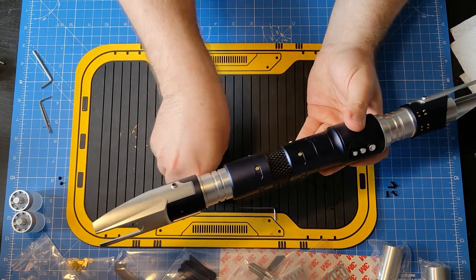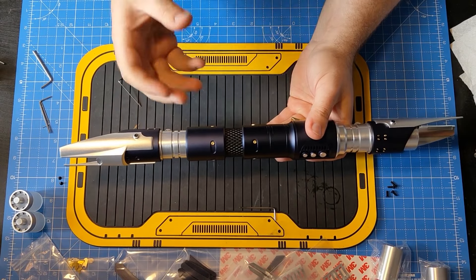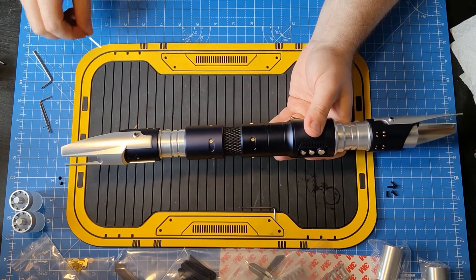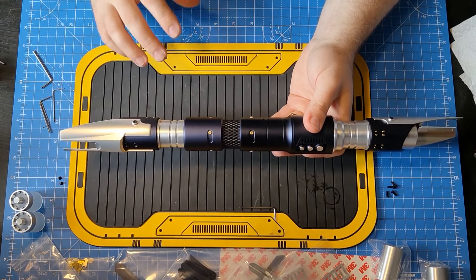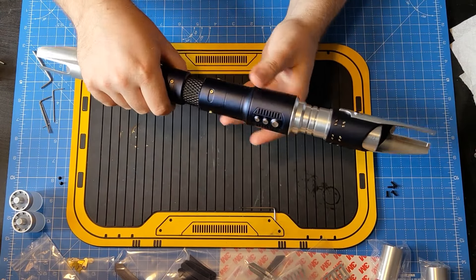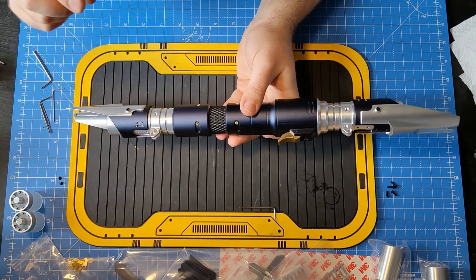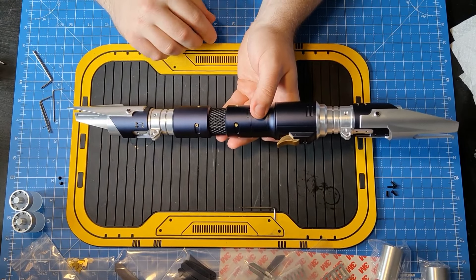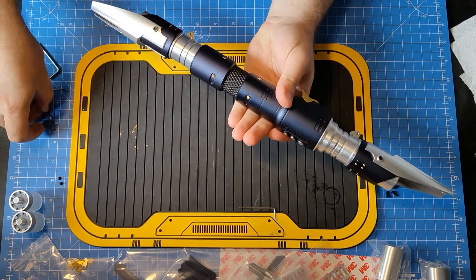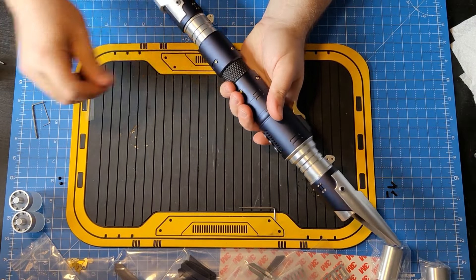There's hidden sound venting here and here. The idea of having the speakers pointing opposite to each other is that if you have speakers pointing at each other, what you're doing is cancelling out the sound and distorting your sound and actually quietening it more. This is a very hard hilt to get good sound venting out of just because of the design of the hilt itself, but what we've got here is pretty nice — I'm quite happy with that. Those are 22mm speakers. The single board chassis takes a 28mm speaker, which is rather lovely.